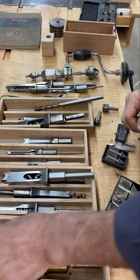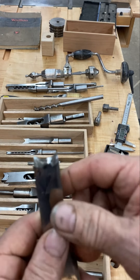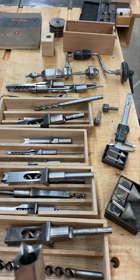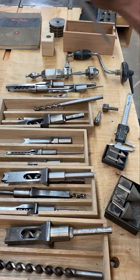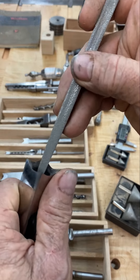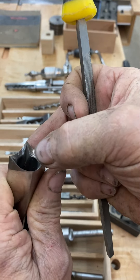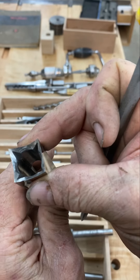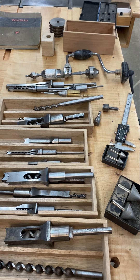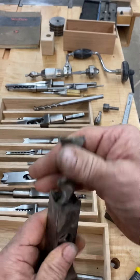The fat wall standard chisels, which are much more robust for hardwood, do have the inside corner filed, as I showed you. That's part of the filing process — you would file those inside corners to relieve part of the bulk, the chisel force. This one is an inch and a quarter, and these ones are probably more for automatic machines that ran heavy pneumatics.